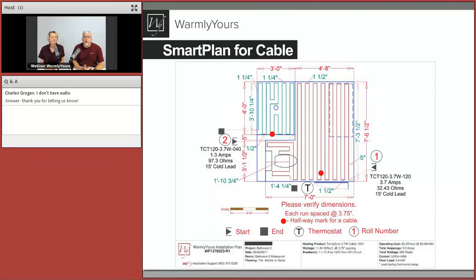The big red dots on the plan show the halfway point of the wire, which coincides with a white marking on the cable itself. When unrolling the spool, you'll see a white dot — that's the halfway mark. Then every foot on the cable it says how many feet are left. You take that white dot on your cable and check how you're doing against the red dot on the drawing. You can use this plan for yourself or for your clients to understand exactly where they want heat.